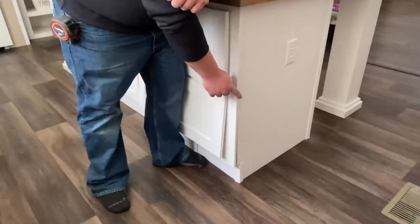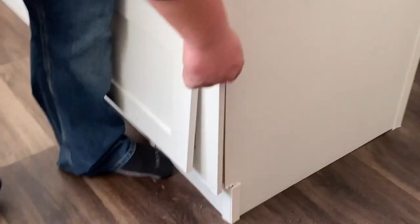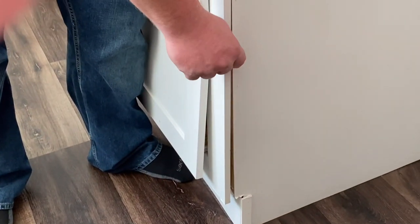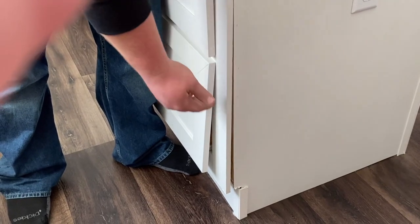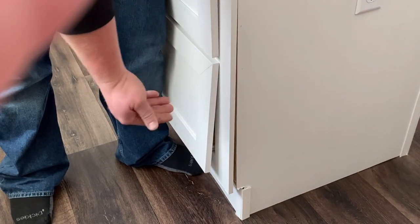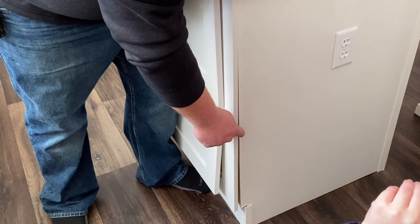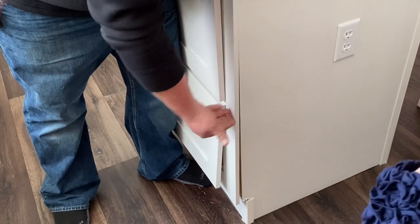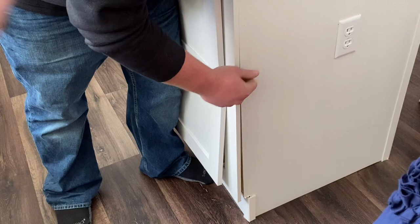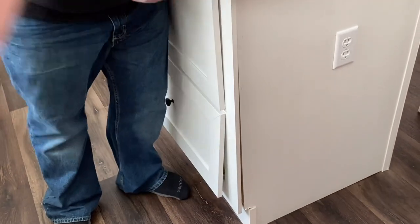If the wife will zoom in here — come over here where they can see it. Look at this face frame, it's come completely off this cabinet. There's not a drop of glue or any kind of adhesive holding this face frame to the cabinet box. The only thing that's holding it on is some small 18-gauge staples — no glue, no adhesive, nothing. So I'm going to have to put some adhesive in there, clamp this back, and put a few more staples in because that's junk.